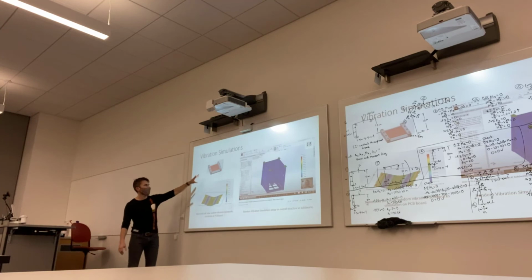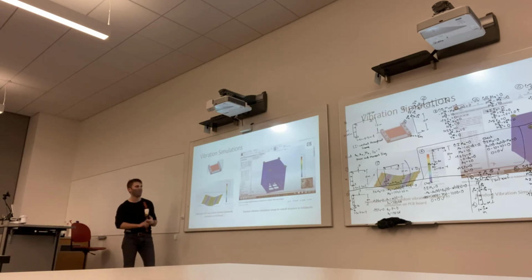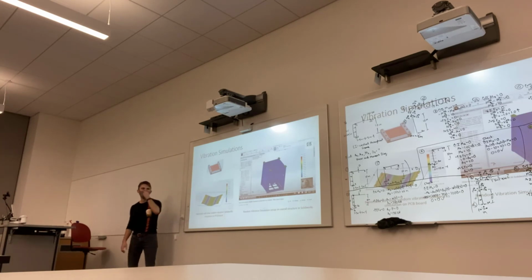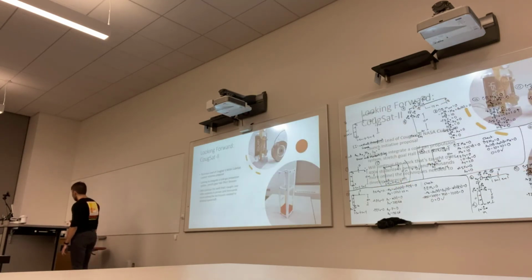But yeah, basically you do it in SolidWorks. In our case for the 406 project, we put our PCB in, we know certain loads are coming in, and it will have a certain stress. You can put accelerometers on here and determine whether a given accelerometer matches up with the simulations. If it does, great. If not, go back and tweak your simulations until it does. And that's a nice thing, because if your simulations match your actual tests, you don't have to shake your hardware as much, which can cause failures. If you test your hardware too much, then guess what? It doesn't pass the actual test. Much like an undergraduate student when you overtest them. Too many of those. So there you go.